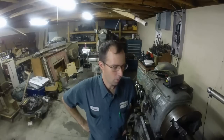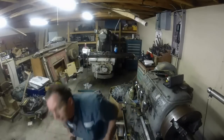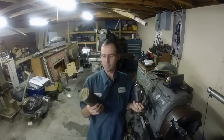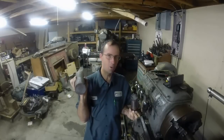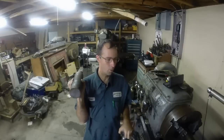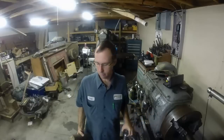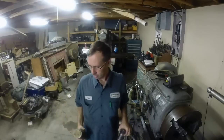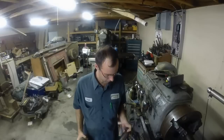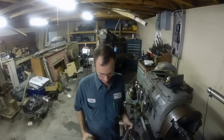So I wanted to get this spindle job here, which has been a repeat failure on a customer's drill. About the third one of these that they've broken. So I'm going to try making this out of a better piece of steel. We've got some Fatigueproof in here, which I'm going to use. I'm pretty sure this was cold rolled to begin with. So hopefully that's going to improve the strength situation enough that they won't have any more problems.